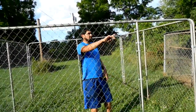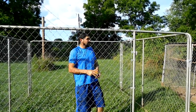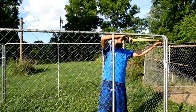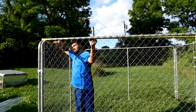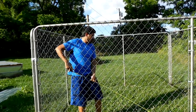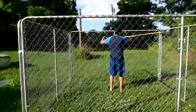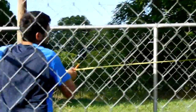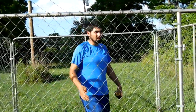What I usually do is measure the top length bars on the back and the front side. I try to hook one of the wires when I'm doing it by myself and go all the way and buck the other bar. I got about ten foot one on the front side. Now I'll check the back — about ten foot half inch. So I'm going to split the difference and go ten foot three quarters on both sides.